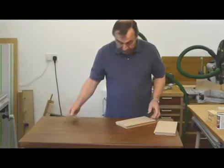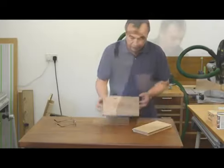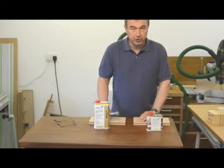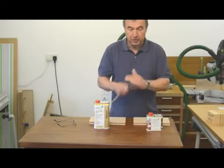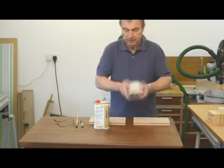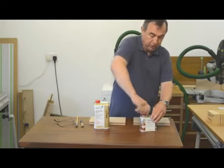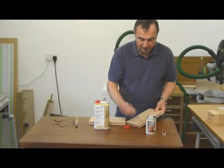I've followed the instructions carefully. After sanding, I've very carefully vacuumed off the surfaces I'm going to apply the oil to. We've got door oil and top oil. I've sanded down to 240 grit because the grits I have go from 120 straight to 240, so that's where I ended up. I've got a pair of bristle brushes, again as per Osmo's instructions, and I'm going to put a thin coating on each of these now. It's important that you give the tins a really good shake, so I'm doing that. I'm going to start with the top oil.